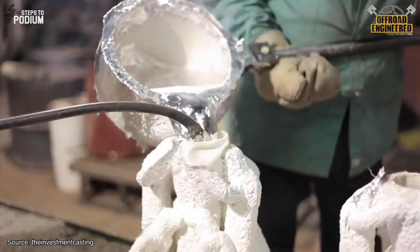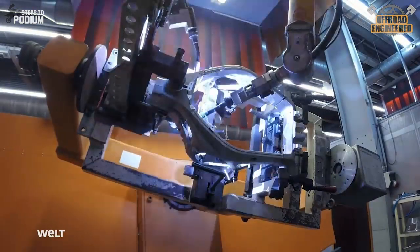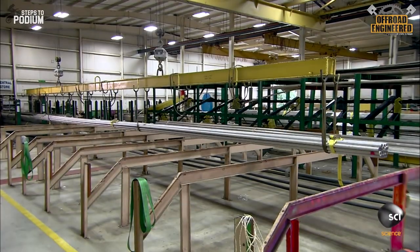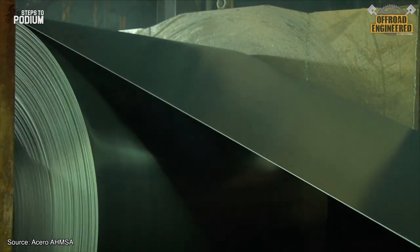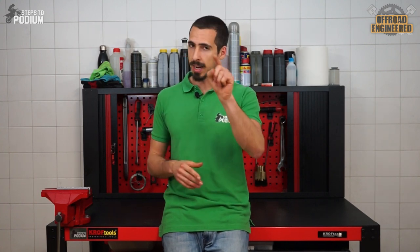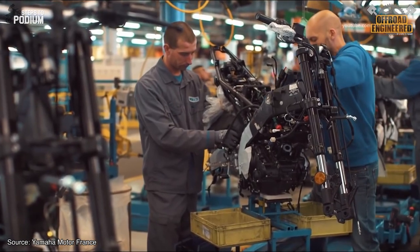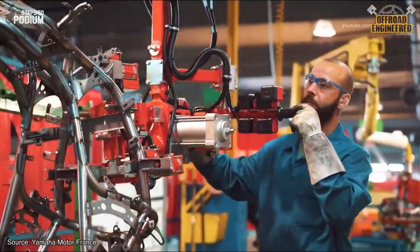In terms of manufacturing, steel is no match to aluminium. First, it's a lot quicker to produce aluminium-casted parts, and it also allows you to cast reliably more complex parts than steel. Second, aluminium is a lot quicker to weld compared to steel and can easily be automated. Third, aluminium is unbelievably quicker and easier to machine compared to steel. And lastly, steel is only cheap if bought in standardized shapes such as tubes, rods, and sheets. From an R&D standpoint, every change engineers make with aluminium only requires changing the cast mold of one of the handful of casted pieces, keeping the manufacturing process exactly the same — whereas on a steel frame, every added reinforcement increases manufacturing time and costs.